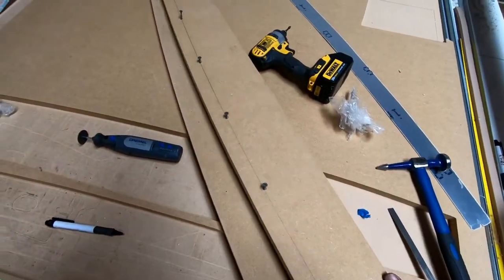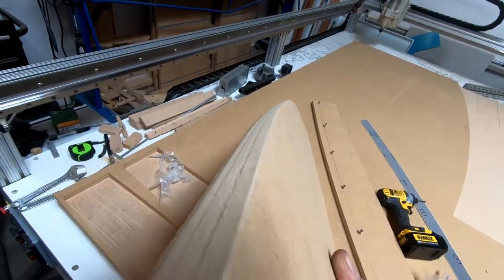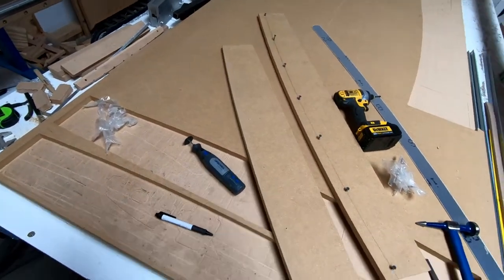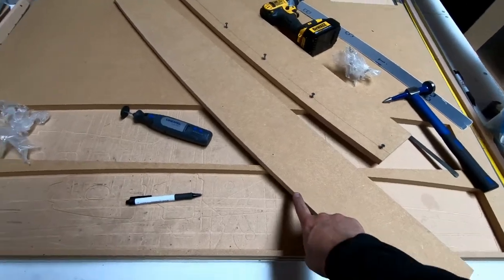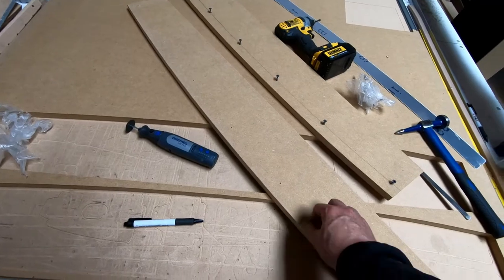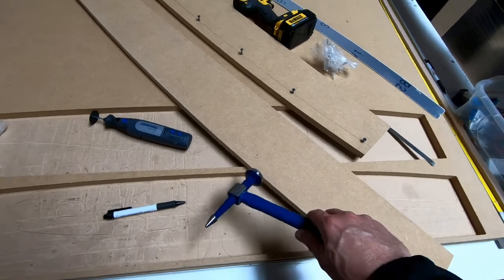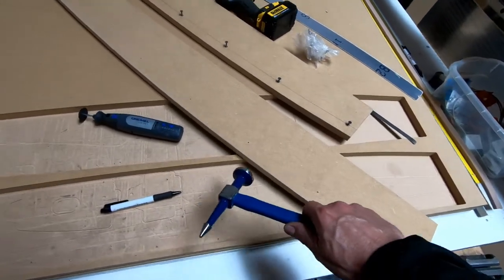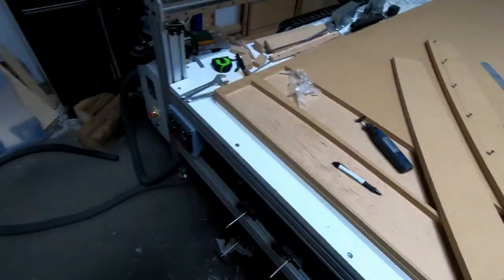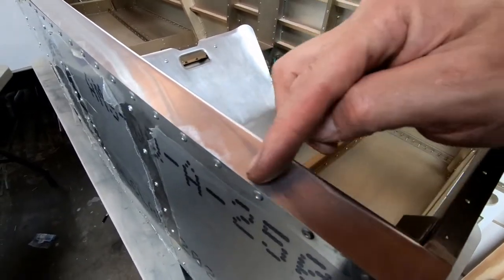And I can tell you, I didn't radius it much. I just really rounded the edge with a piece of sandpaper, but it's very difficult with this compound bend here to get a tight radius, because you're pounding this down and it doesn't want to go flat, and so it doesn't want to create a radius. If I had gone around it with a metal hammer, I probably could have gotten that radius a lot tighter, but I'm not sure I could have done that without putting dents all the way along the outside of here, because as I would pound on here, this doesn't want to sit flat.